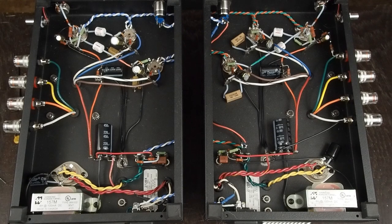We're winding up our little build here and I went ahead and installed these coupling caps on the monoblock that we're doing the slow build series on. This is the one we built first and this is the one we built second. As you can see, these are mirror images of each other. I went ahead and soldered in these coupling caps that go from the plate over to the grid and then from the cathode over to the grid. We've got a few parts left to install.